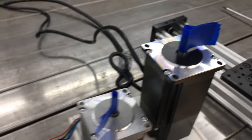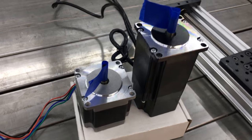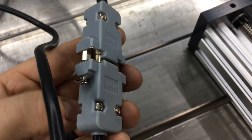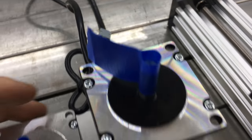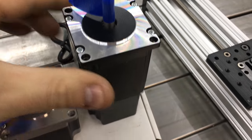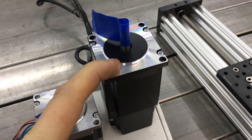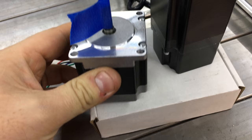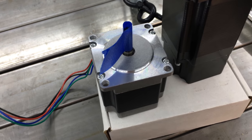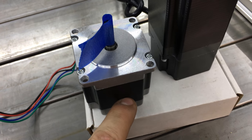And this one is 2.2 newton meters. Both of these motors work and will get you from point A to point B. Here's the reason I'm going with the hybrid stepper motor: it gives you feedback based on the motor's performance, and the controller can handle the voltage to adjust for incoming workloads that are greater than what's currently being provided to the motor. In plain English, when the motor is struggling, it gives it more power — versus a regular stepper motor where it's stuck at whatever power level you set it. So you want to set it high enough to do all the jobs without it stalling. That's how you normally set up a stepper motor.